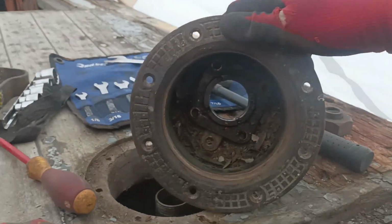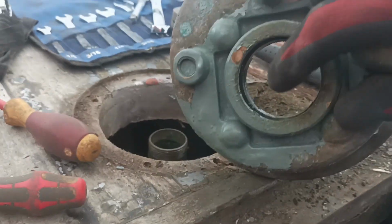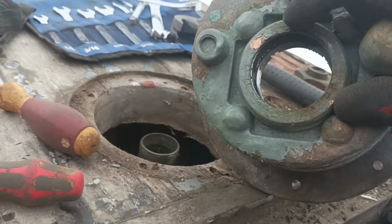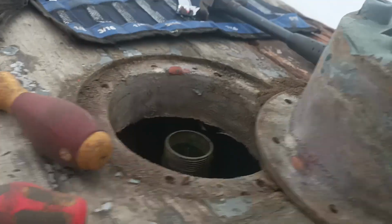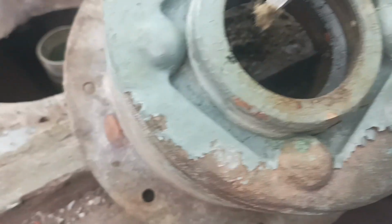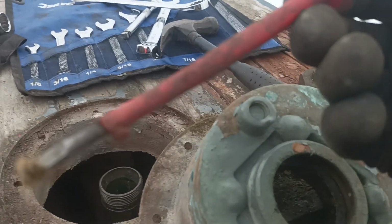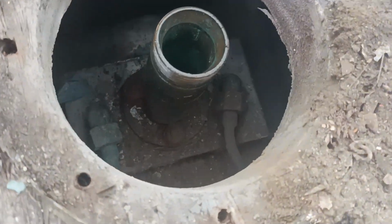And that's how you take the filler cap away. The seal's all gone in there, because usually there is a fabric seal that goes in there to stop any ingress into the diesel tank. There we go, you can see the seal. Alright, that's that out. Put that over there, and we can have a look down it and see we've got those two connections that we need to get rid of.